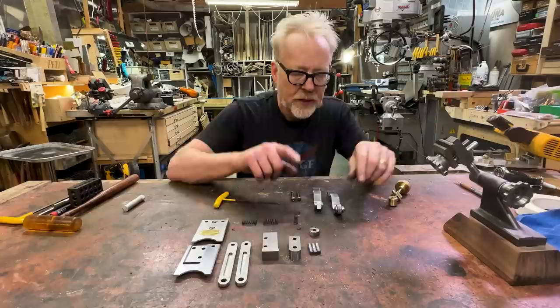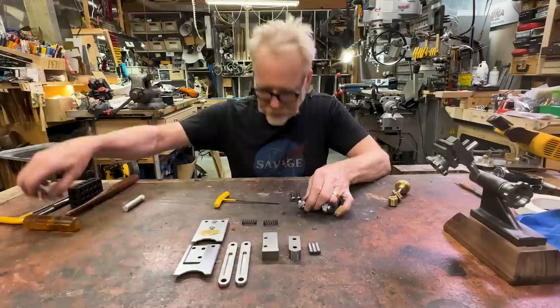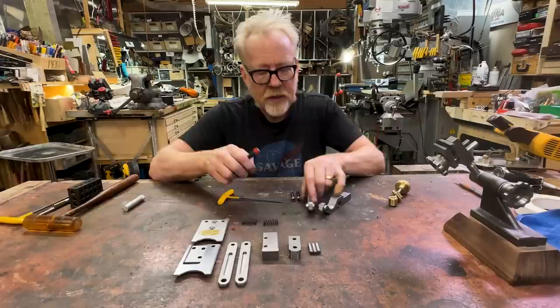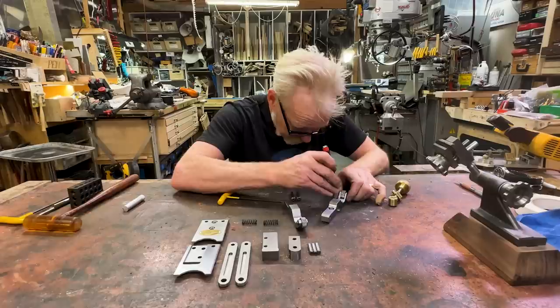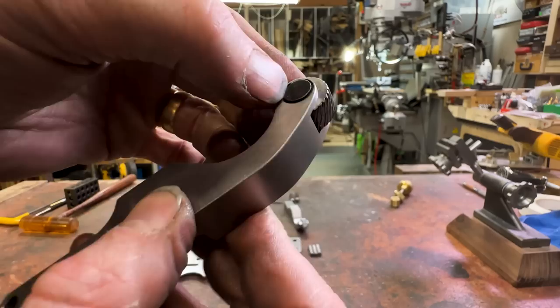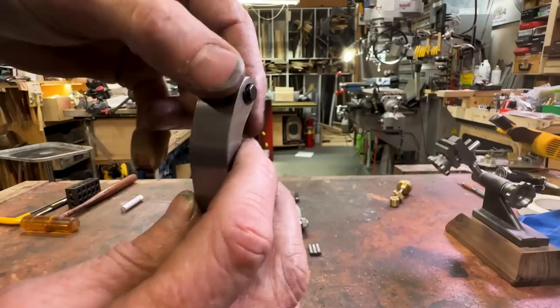And these little clevis pins are held in by circlips. Circlips are a technology for securing something when you don't have a lot of room. And they allow for a very low profile securitization of pins. I'm going to hold one of these up for you to see it up close and personal. So here you can see the countersunk flat head sitting inside of that. It's only 100 thou from there to the wheel. And then here is the circlip. You see, it's just that little bit of hardened spring metal, it goes into that little slot and captures this.